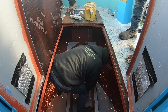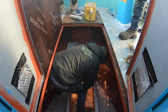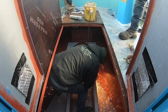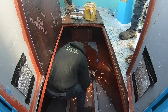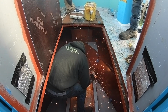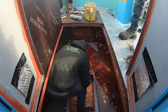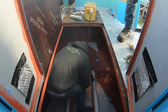This is because the flywheel on the new engine sits wider, so there isn't enough room to actually fit it in that opening where Connor's got his foot at the moment. So he's having to take a section of that away, and also then add pieces front and back on either side so that the engine mountings can go straight onto those, and he's put gussets onto those, so there's plenty of strength in there, and he's using the same 10mm steel as the engine beds are originally. So sit back and watch a really hard job made to look easy.